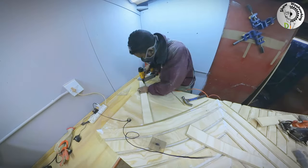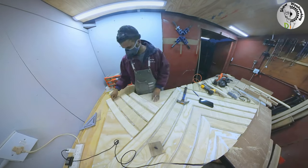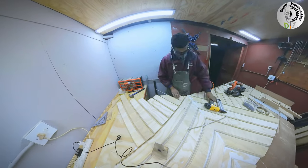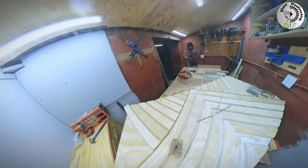Here's the closer look I was talking about. I put the eight millimeter dowels straight to the corner of the door. With these side pieces we don't need to cut any angles — we just keep it at 90 degrees, then leave them to overlap on the sides, come back with the circular saw to flush trim, then fill up the rest of the gaps. We're basically done with this panel.